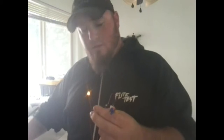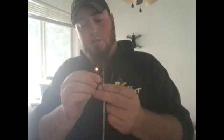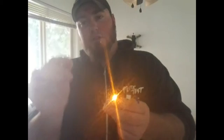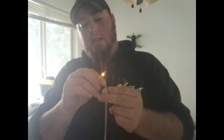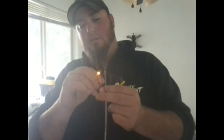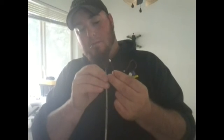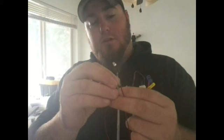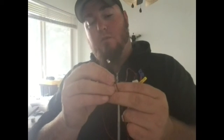So then, what happens as your voltage trips the alarm? I'm just using a small flat blade, or flathead, and I'm going to adjust the tuning up until, oh wait, I need to, okay, so on the flashing circuit, all I'm doing is adjusting the voltage up above what the voltage of the battery is. That way I can trip the low voltage alarm.